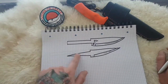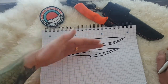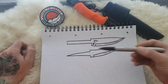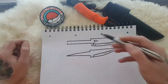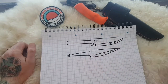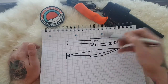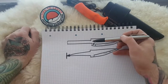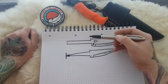This tapered one here is your more traditional shape, and this allows for a wedge type axe head fit. Also, down the bottom, these are usually a little longer, which my drawing doesn't illustrate because it's terrible. This lets you tap and die out and thread the bottom of these, and you can affix the handle mechanically to the bottom of it, which causes a pressure fit. Most Puukos and traditional Scandinavian knives would have this type of tang construction.